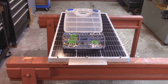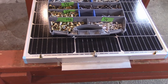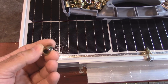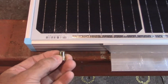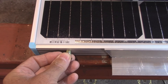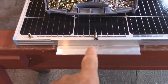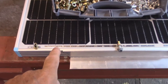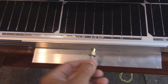This is the first part I have to do. I'm going to show you exactly the parts I'm using — I'm going to be using these rivnuts, they're quarter inch. They come in different sizes but I'm gonna use the quarter inch. I'm gonna drill through the aluminum into here. Of course this is just a demonstration piece — this is an inch and a half, one-eighth aluminum, and the bolt is just going to bolt on.